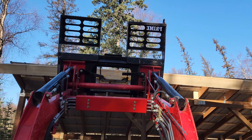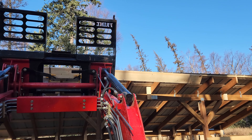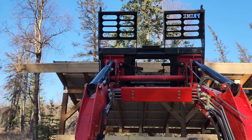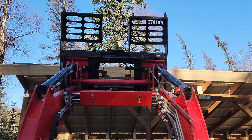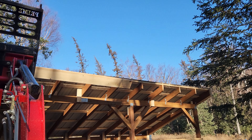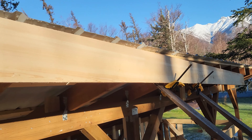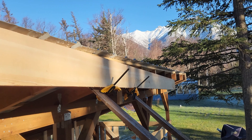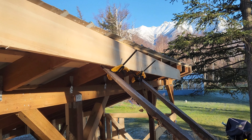What I've done is raised up the loader arms as high as they'll go with the forks up there to see about having something to hold it up there roughly in place. Obviously it's hanging off the end pretty far — that's okay. I'm going to get my ladder out, slide it down, and see where it lines up. I may have to do some trimming, cut it to length. I haven't even measured exactly how long it is, but I'm going to end up probably having to trim it down a bit to match up to the end of one of the rafters. Using the forks and those couple of clamps to just sort of hold it roughly in place, I can get one screw down here in this end, move the ladder, go down there, tack up the other end, and then secure it the rest of the way. Creative solutions for working alone.